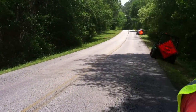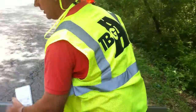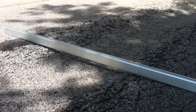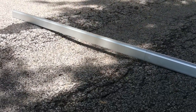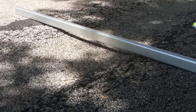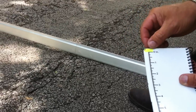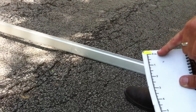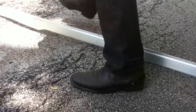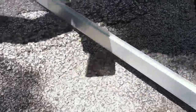Now let's go have a look at this before the traffic starts up again. If you look at your micro paver guide, we have metric for Canada and inches for us here in the USA. In this case I want to point out that the top half-inch or quarter-inch — we need to add that to whatever increment we measure. And in this case, I'm clearly seeing almost two inches of a rut.